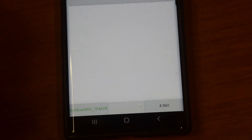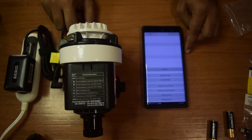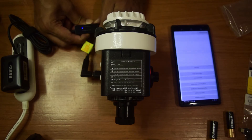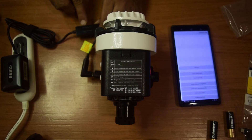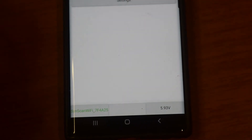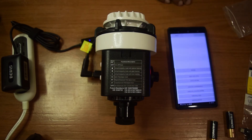Now let's increase the voltage to 6 volt and see how it looks. I'll disconnect the Wi-Fi first, then hold the toggle button until it starts blinking, click once more to move to 6 volt, and leave it until the power stabilizes. As you can see the power is stabilized at 6 volt. On the mobile app it now gives 5.93 volts — so at 6 volt on the power supply, the module is overvoltaged at around 5.93 volts.